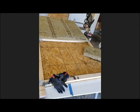The first thing I did was pick my materials. I used 2x3s as my main frame. I had these galvanized tie brackets laying around that I modified. In between all the panels I bought rock wool sound insulation — it's really made for acoustics, not thermal. I got a pretty good amount, around 24 square feet, for about 50 bucks at Home Depot. It's called Rock Wool Safe and Sound.